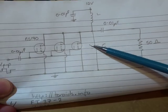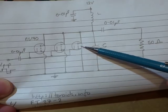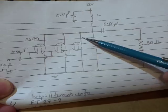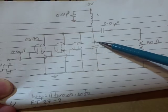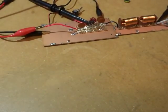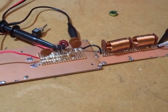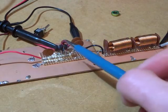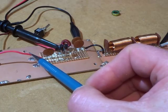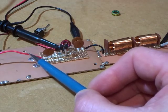This capacitance value also needs to take into consideration the drain-to-source capacitance of your MOSFETs. In this case I've got three devices, and capacitors in parallel add together, so I need three lots of that drain-source capacitance factored in. Before I turn it on, the amplifier is over here with the follow-on low-pass filter. We've got the three BS170s, a 0.01 microfarad coupling capacitor through that red wire bringing in the 5 volt switching voltage from the signal generator. That's currently set with a duty cycle of 50%, which I'll talk about later on.